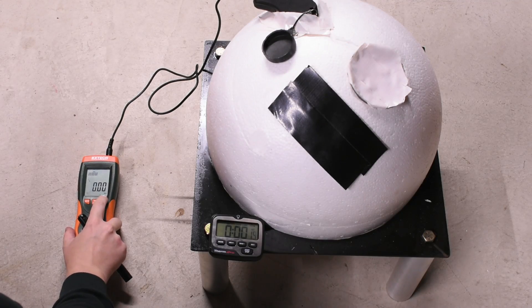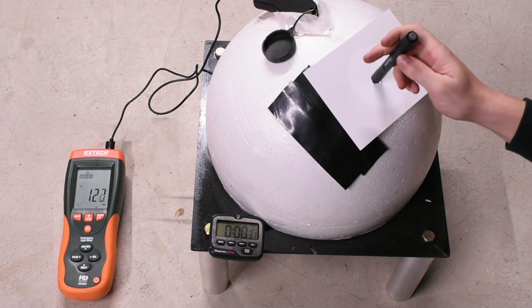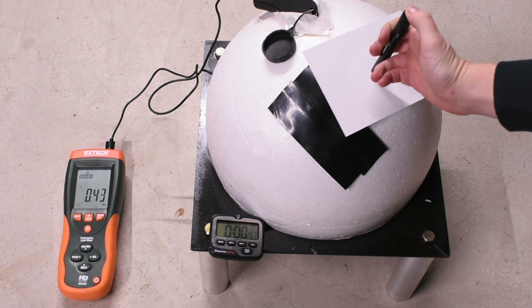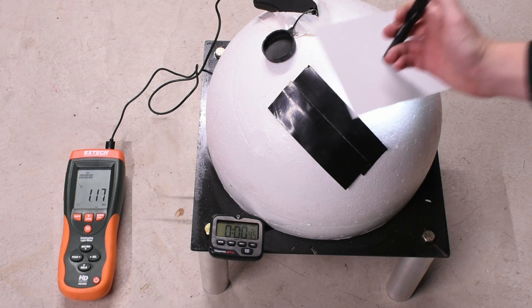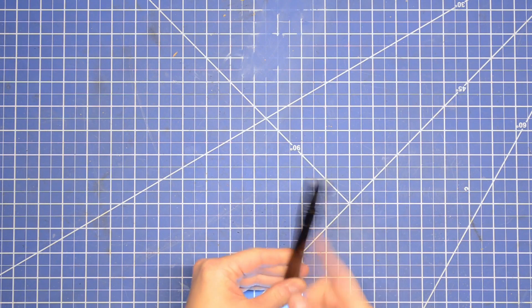In episode one we had a lab verify testing down to 127 lumens, so we should be in the ballpark. Waiting 30 seconds per the ANSI FL1 standard, we're seeing 120, 121, 122 — about 120 lumens. Low is about 45 and high again at 120. That's 86% of their 140 claim. Not amazing percentage-wise, but that's only a handful of lumens, and at this level every bit helps.